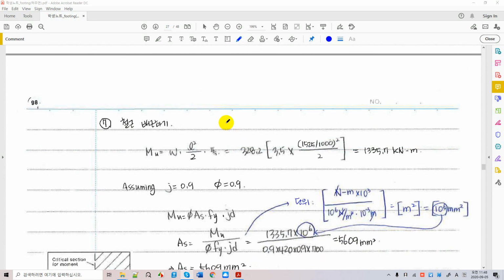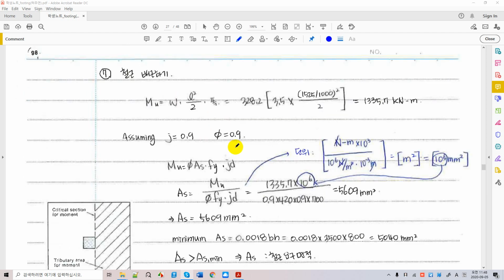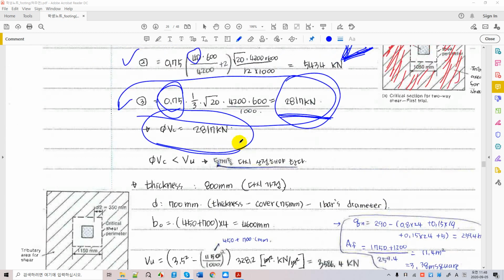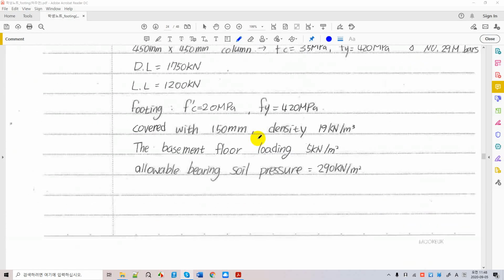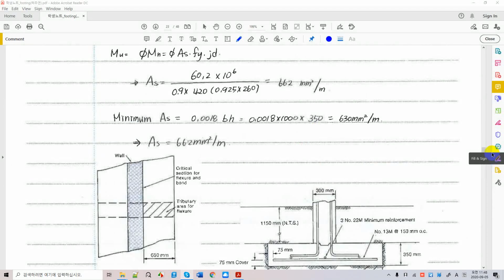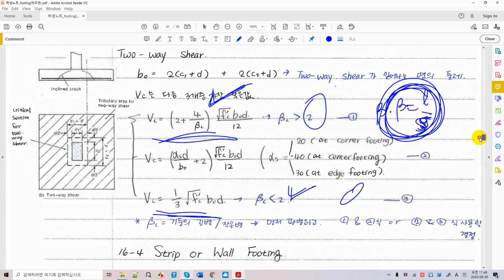Anyway, the second very important step is to place rebar. The rebar is not shear reinforcement, as I said, it is flexural reinforcement. So what do we mean by flexural reinforcement? Rebar to protect the foundation from bending moment. And you want to go back again to flashback something. The moment is based on the entire section of the foundation from the face of the column, as I explained.